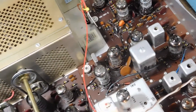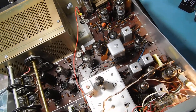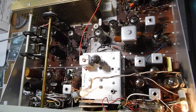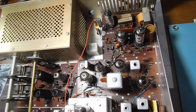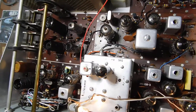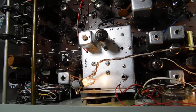This one had a couple of problems. They had a couple of tubes that were actually the wrong tubes — the heterodyne oscillator and the VOX amplifier tube were 12AU7s instead of 12AT7s. The RIT mod is mostly inside the VFO compartment here.